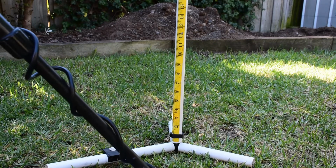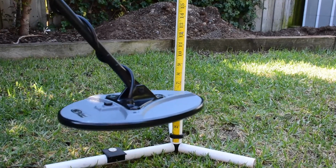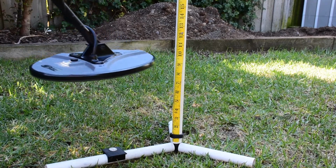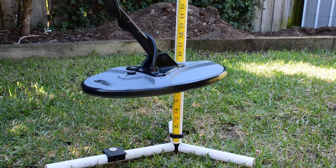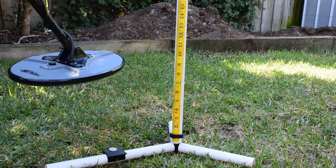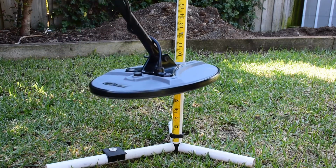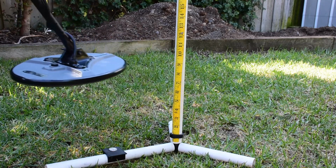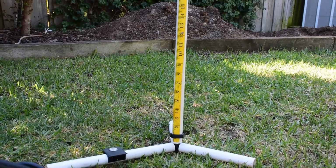here we go. So we're approaching 9 inches there. Still getting response at 9 inches. And there's a plane going overhead, which is annoying. So I'm getting the response, I can just hear that with my ears, at 9 inches with the 5-cent coin.